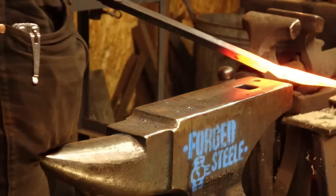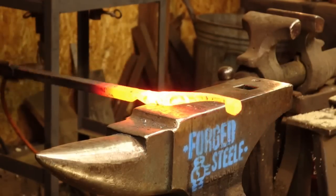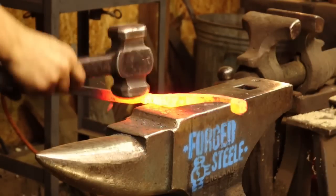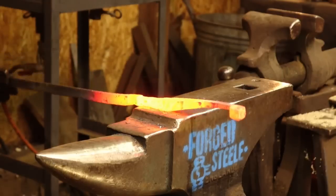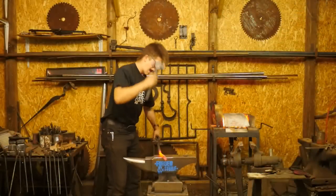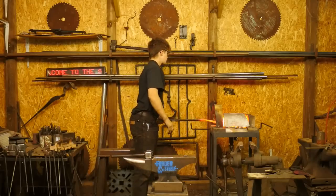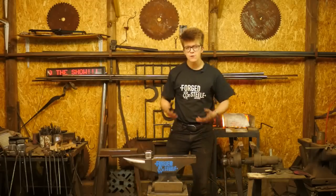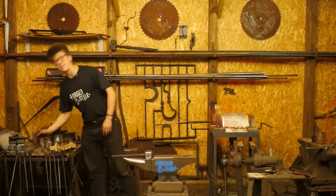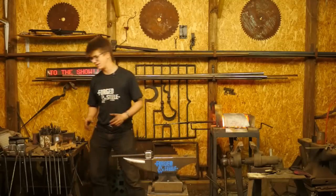For the reason that I can get right in close to the anvil without there being a big stump. And I can very easily bolt the anvil to the steel stand. And I can very easily bolt the steel stand to the ground, or in this case, stake it to the earth. That's why I like a steel stand, specifically a tripod stand with the legs at certainly not more than like a 10 degree angle, so you're really getting as much return from your work as possible. Steel stand is also much lighter. Wooden stand, very difficult to mount to your concrete. I do like the steel stand, it's my personal preference. And I would like to believe that it stands with some sort of rationality. That would at least be the hope, the dream, and the aspiration.